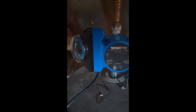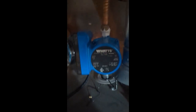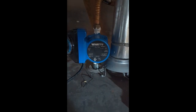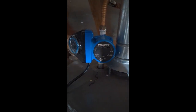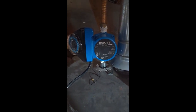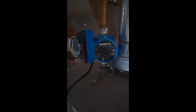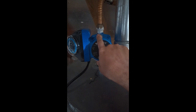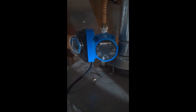We're up in the attic. This is my hot water heater, and I've got the hot water recirculation pump already installed. I went ahead and put it in line right here. This is our hot water that leaves and goes into the house, coming out of the tank. This fills up the line so that you have hot water at every faucet. In my house there are two loops, so this pump stays on, runs that loop, and keeps that hot water going.